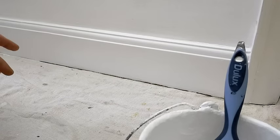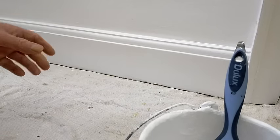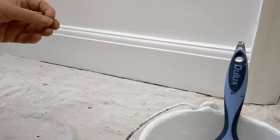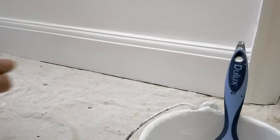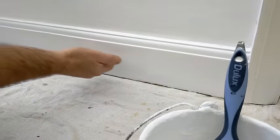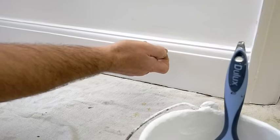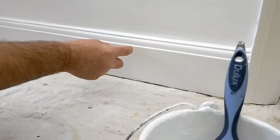Choosing a good paint helps. When you're spreading the paint out, if it's got good opacity then you don't tend to apply too much. Paint that's not got good opacity means you may tend to put too much on and get curtains running. If you're overloading it on the top edges, you get a build up of paint that sits along the edge and then you get curtains sitting just on the face.